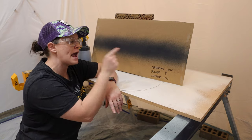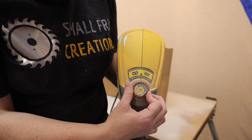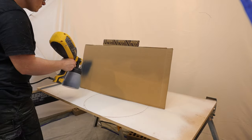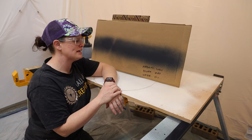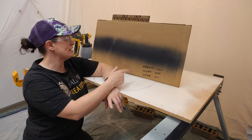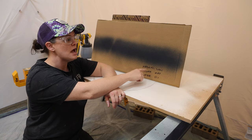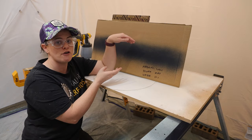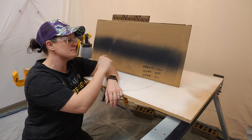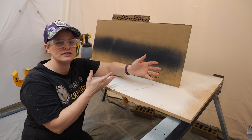So I'm going to turn the power from five all the way to max and have another go. Now we're getting somewhere. By turning the air power up to max, that has achieved a nice amount of paint being pushed out consistently across the cardboard. We are still in the narrow pattern because my material setting is set to low. I think if you're using the detailed nozzle, you're probably painting something small or furniture and you're probably going to want a narrow pattern. I am still getting some overspray top to bottom, and to be honest, I don't know what a normal amount of overspray is — that is part of the reason why I'm doing this experiment.